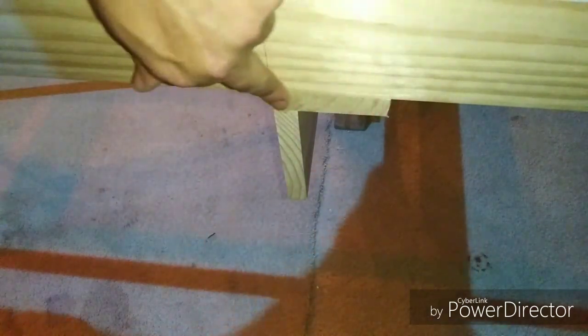This is showing the end of one of the L-girders. I've got a 1x6 capped with a 1x4. This joint, down the entire 8 foot length, is glued, clamped, nailed, and screwed. The critical portion of this is the glue. You want to make sure you glue it and clamp it. The screws and the nails, I just saw no reason to remove them. But that's what's going to give you your strength — the glue.